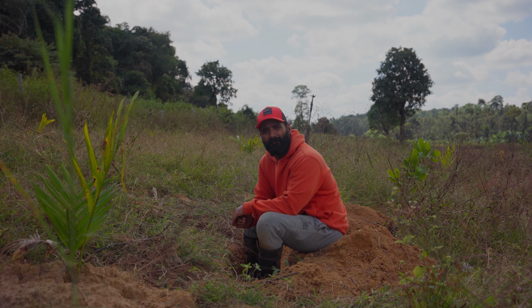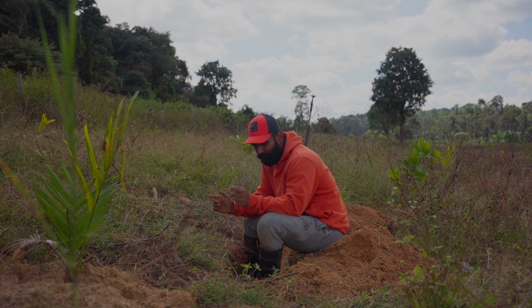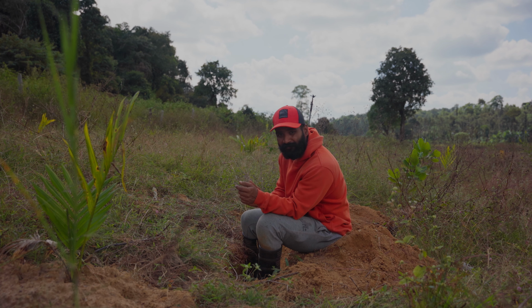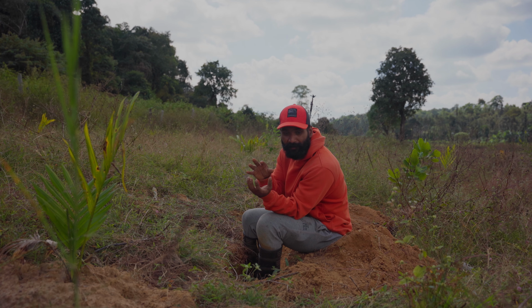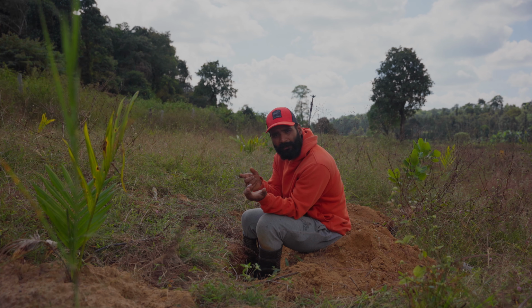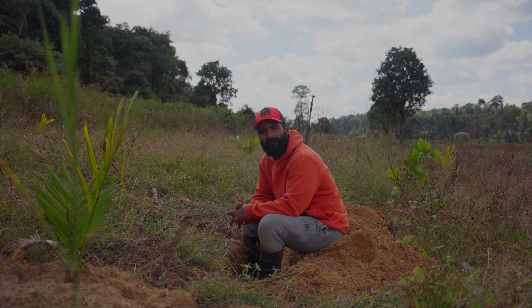One of the things that you have to keep in mind when you're doing this, make sure that you're not just fitting the pipe in that particular area. You have to dig maybe 3 feet on either side and lift the pipe up a little bit so that when you're fitting it, it becomes easy for you to do it. Because otherwise, the pipe is not going to sit properly, and you're not going to get the results that you're hoping for.